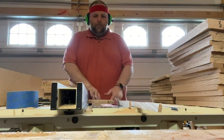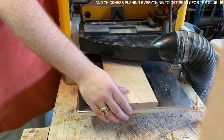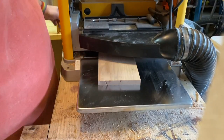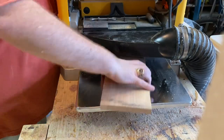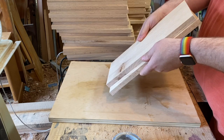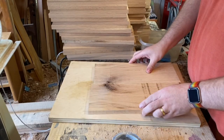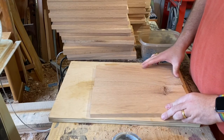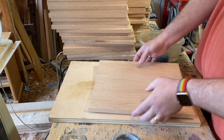I just repeated this process a whole bunch of times until I had things like I wanted them. Then I did end up going through and thickness planing everything to get it all down to a uniform thickness. That ended up making the glue-up a little bit easier if all the thicknesses were the same. This is that same ugly board with the knot on the inside — most of this lumber is actually really clear; it just worked out that this one happened to be the ugly one.